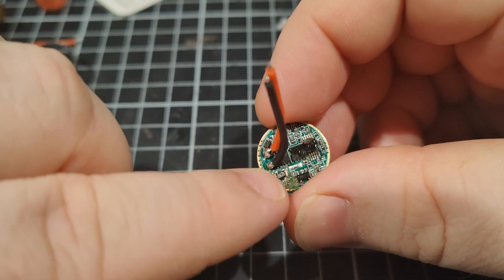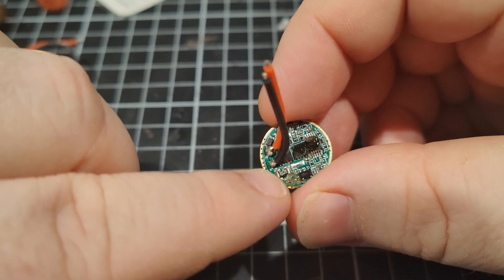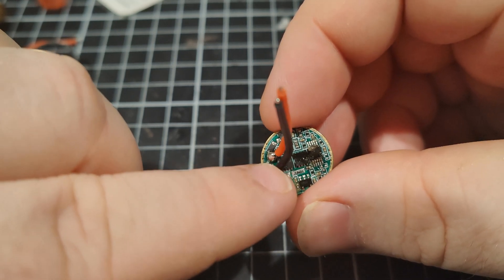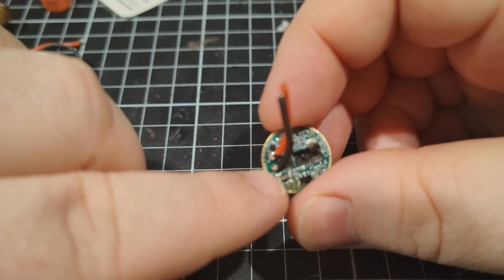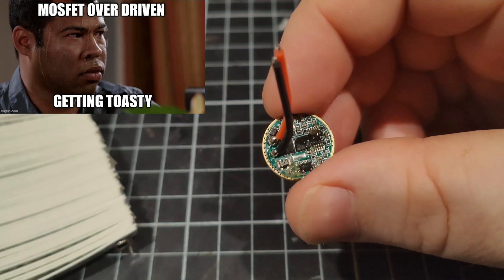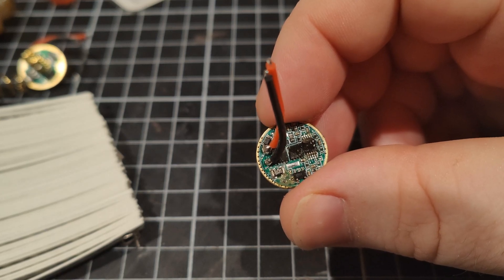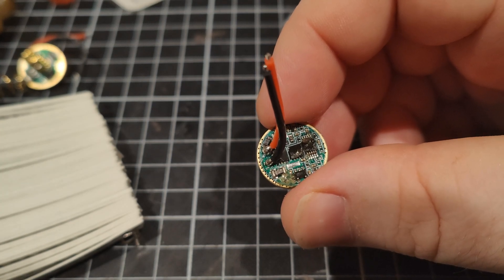If you were to put the new R020 resistor in series you would double the resistance. You could just unsolder this one and resolder another value on top — you'd have to work that out yourself — and that would give you a custom amount of current. Obviously these MOSFETs and the rest of the driver do have a maximum amount of current they can handle safely before they burn out. So far it's been okay just bridging it — I've seen these drivers do about 15 amps and they're still going. They can handle quite a bit of current, but keep in mind there is a maximum.